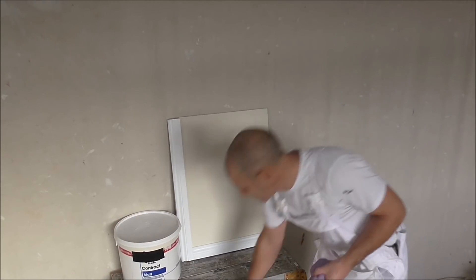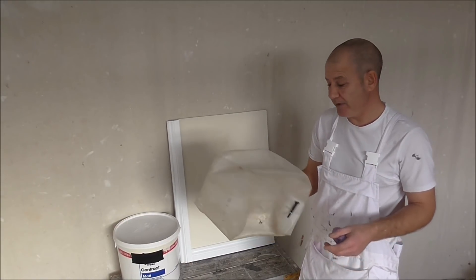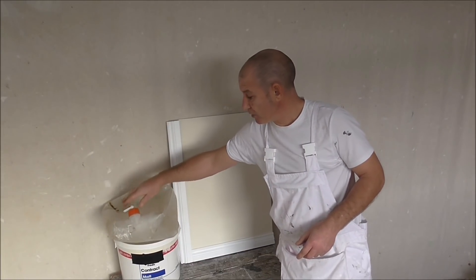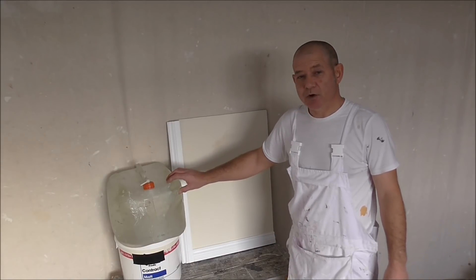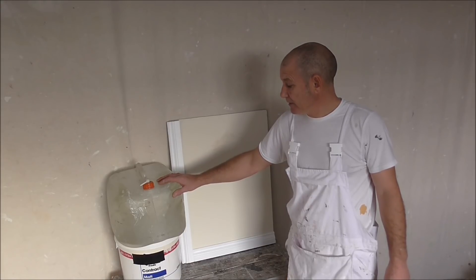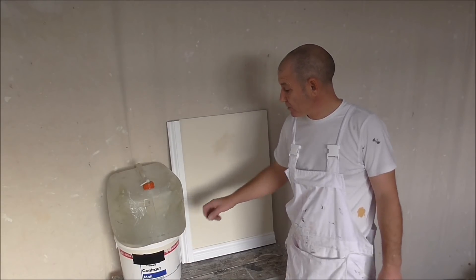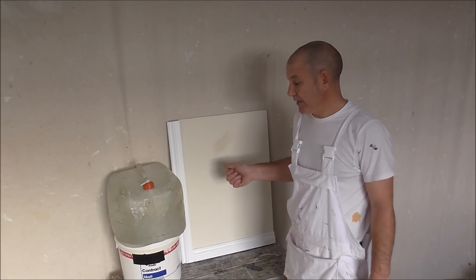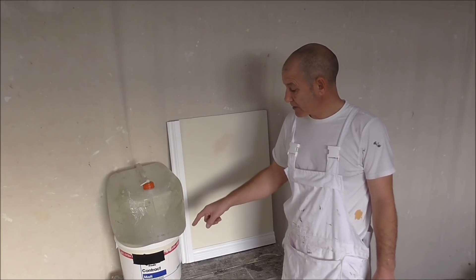What I always carry with me if I'm going anywhere with new plaster — because I mix PVA, but if you're mist coating you need water — I'll always carry one of these. These hold about 15 litres of water, which is plenty enough for your day. It's essential that you water this down before it goes on, or wet the plaster first and then put your paint on neat, because either way that paint has to be thin.